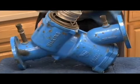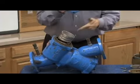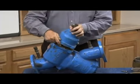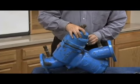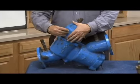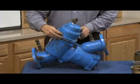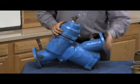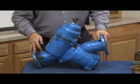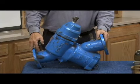Now we can reassemble this, making sure I've got the wide passageway here on my cover over the little recess. Line up my 4 holes, bolt holes. Second check on the 2.5 and 3 inch is going to be uncontained. So as I go to put it back in, I'm going to have to compress that spring and shove the cover into the second check. That's the check assemblies on the 575 and the 550, 2.5 through 6 inch.